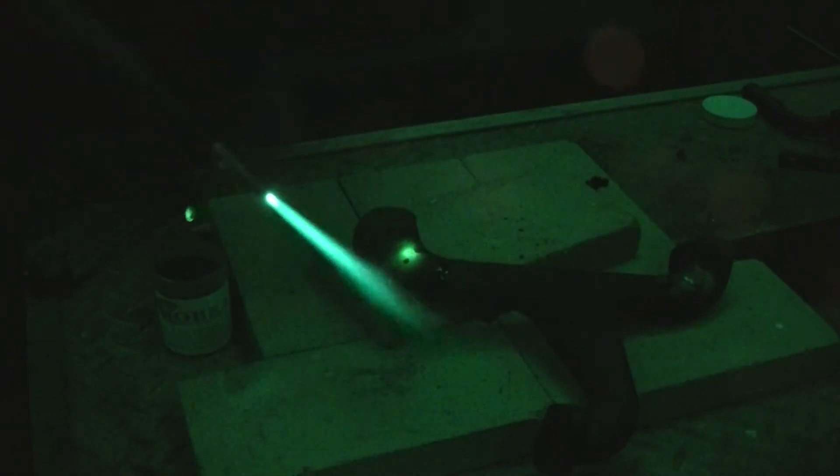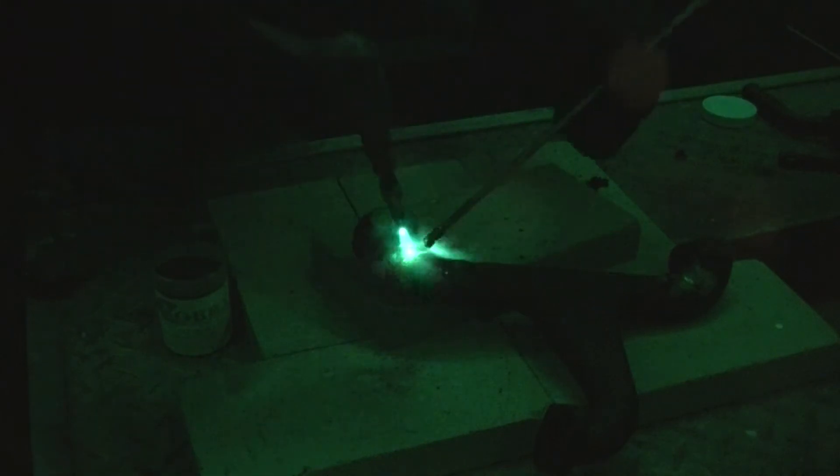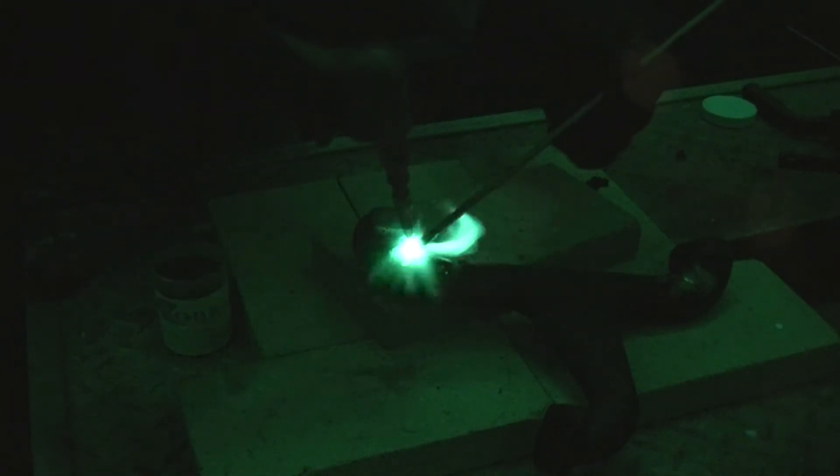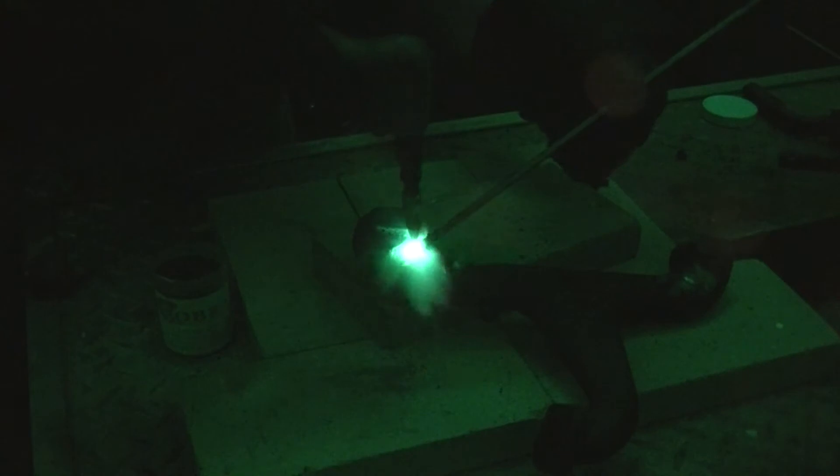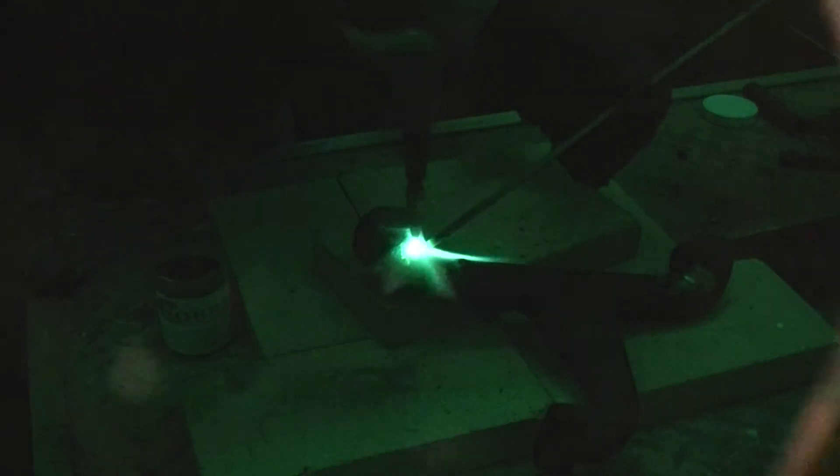If you need a little more flux, just take your rod and re-dip it in there, then come right back to your surface and get your material to flow. Make sure your manifold — the base metal — is flowing when you add your filler. The filler will flow right in.